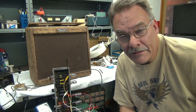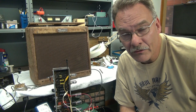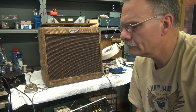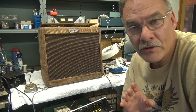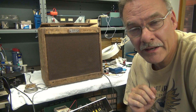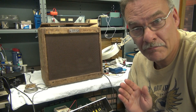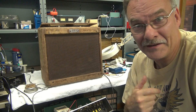So I'm going to go ahead and put her together, solder that last lead, put on a dummy load, let her bake for a little bit, and make sure it's good to go. But so far it looks very promising. One thing I didn't mention on the test setup: I always use an 8 ohm non-inductive dummy load on the output of the amp when I'm checking for bias. Always make sure you've got a dummy load or a speaker hooked up at the right impedance, or you can mess up that output transformer.